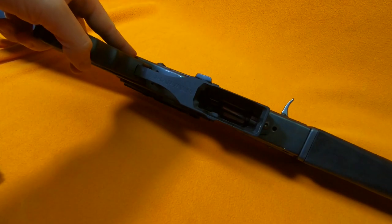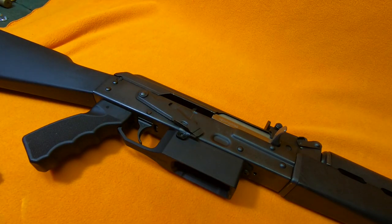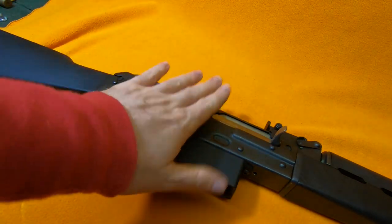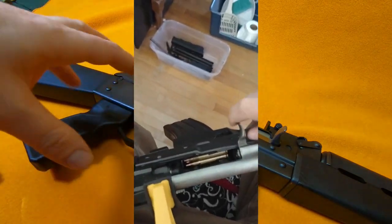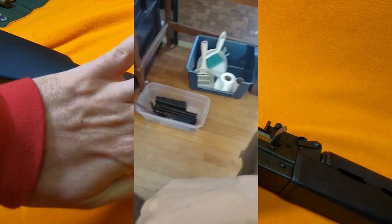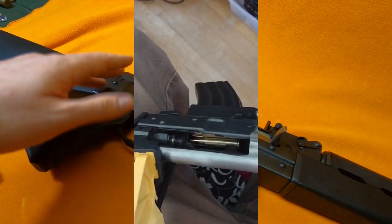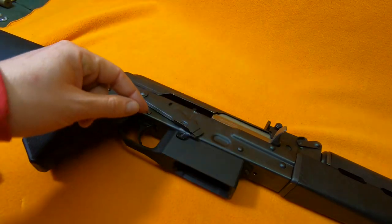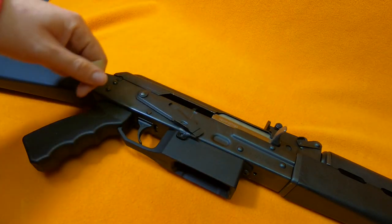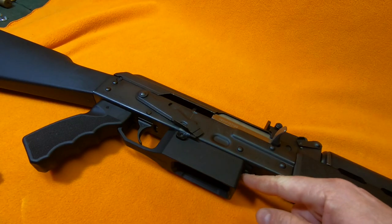Then I found Schaefer Machining, and this is so easy even an idiot like me could do it. All you do is cut off everything and leave the receiver bare. Using either measurements or by inserting the mag to align it, I used clamps to make sure everything was lined up and feeding correctly while drilling. You drill four holes. There's a screw here, here, and here, and the last one requires a nylock nut you put in through the receiver and hold in place with a wrench while lining up the screw. It's annoying, but in the end you get this nice full metal machined single piece with the trigger guard integrated.